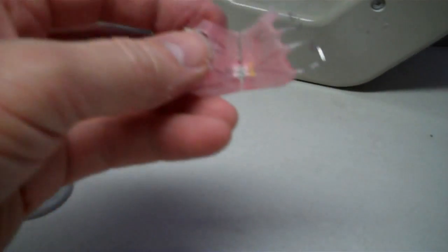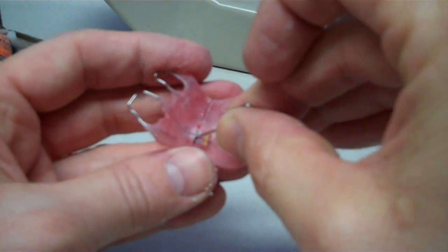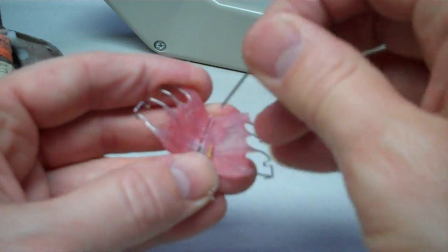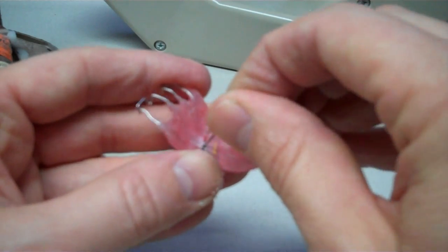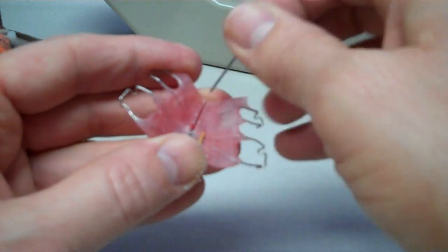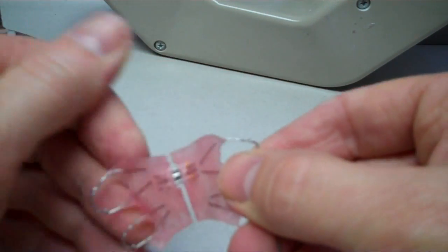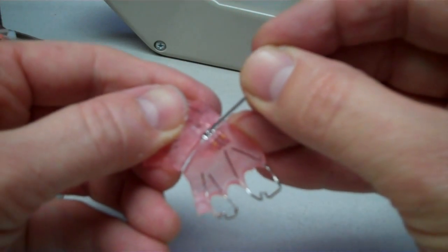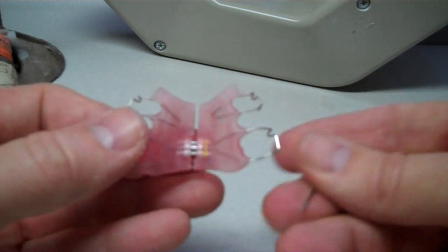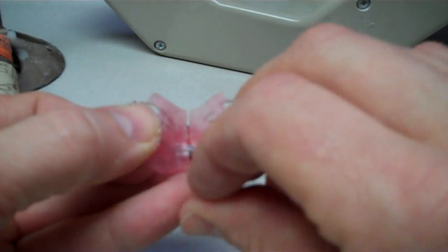And we cut right through till it's completely exposed, and then if we take the key and turn the key 1, 2, 3, 4 turns, that's 4 turns, a quarter millimetre a turn, that's a millimetre opening now. At some point during that sawing stage the little pink bit of nylon that was down there has gone. So that's how we separate. There was 4 turns opening, so I'm going to just turn it 4 turns back.